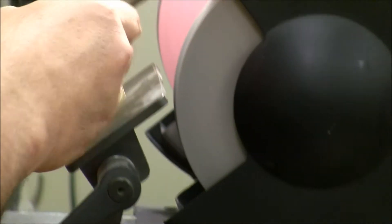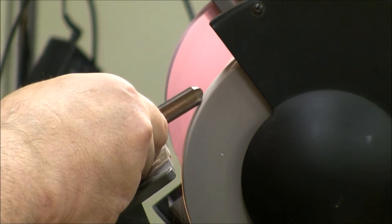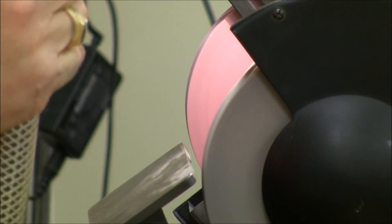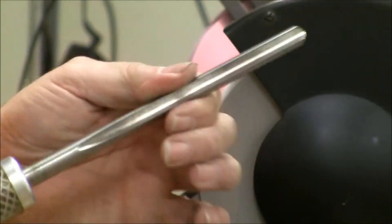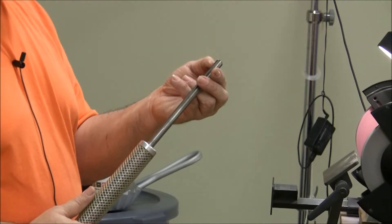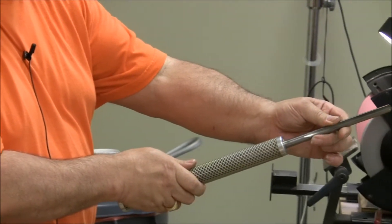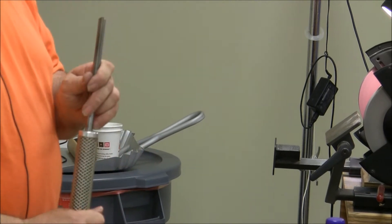It's going to foul the wood and possibly put rings in the bottom, which I don't want. So I'll bring the tool up, and where this little micro bevel is — where the heel is — I'll grind it away and make that bevel as small as I need it to be to make that turn across the bottom. So without having to re-grind the entire tool, I can just grind away that heel and make the bevel as small as I want. You're not really changing the profile of the cutting edge, you're just giving more clearance. Exactly.